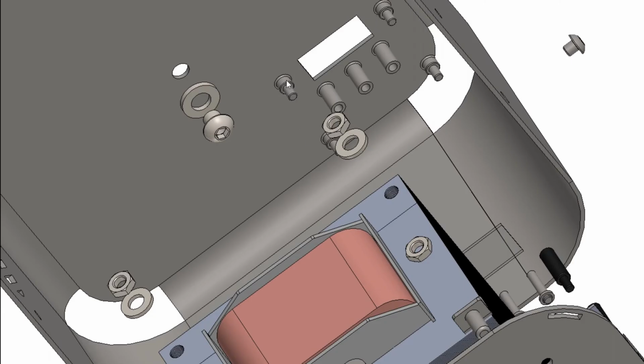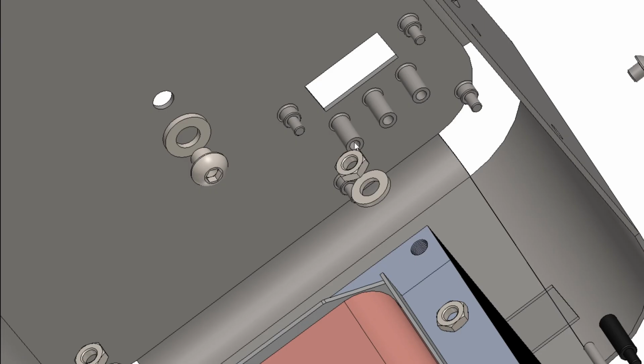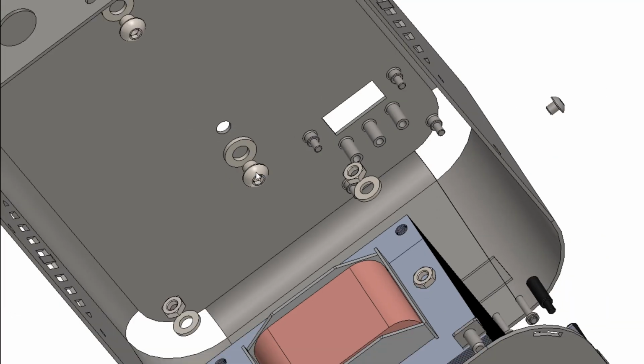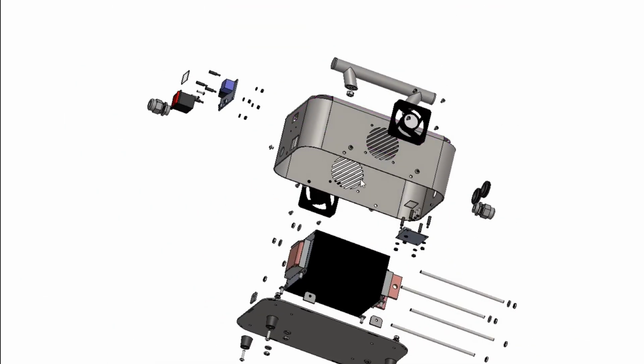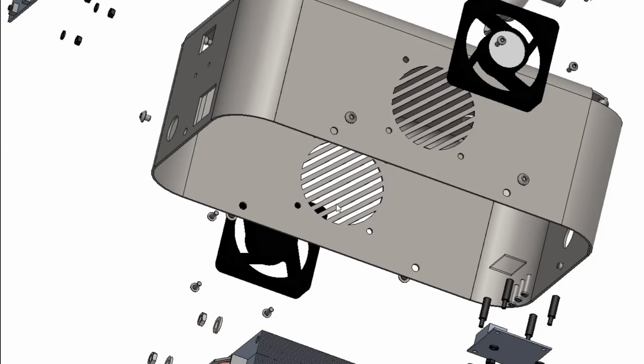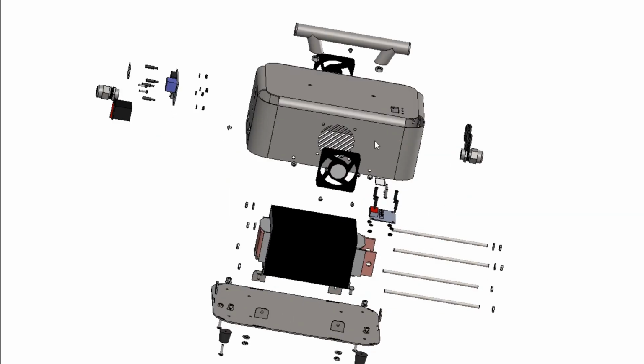So that wee transparent glass is just epoxy glue down here. There's also more cap bolts. They're only about 5mm long, tack welded onto here with a TIG, or spot welded you could say. And there's one here very close to the edge. And this is also 3mm tube with 5mm on the outside, and the wee bars slide up and down to control the buttons. That's dome head and washers for the handle. These holes are cut using a laser machine. The box was initially designed as a 3D model, then I flattened it. I will show you that in more detail now.